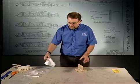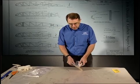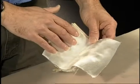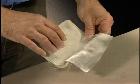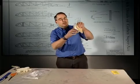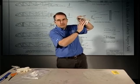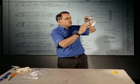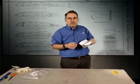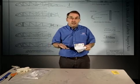There are a couple different ways to do that. One way is to take the fiberglass materials and apply it to the joint and then using a brush or a squeegee apply the resin to the glass. That's okay but there are some troubles with that if you have tight quarters, or perhaps you have an overhead where the joint is up high and difficult to get to, and you have issues with the resin perhaps dripping on you. So I'd like to talk about a method where you can essentially pre-impregnate your fiberglass with the resin before you actually start the layup.